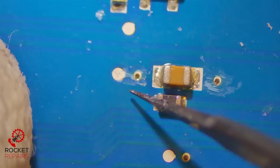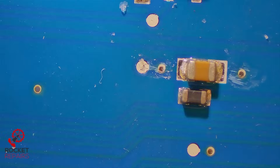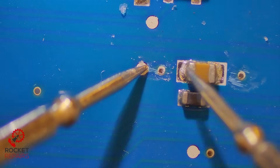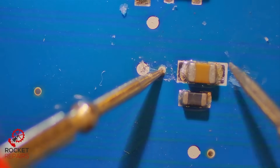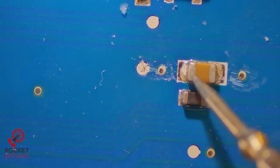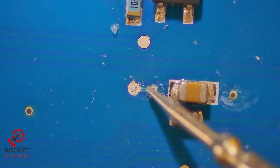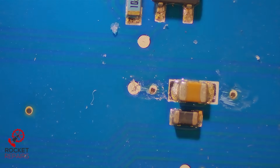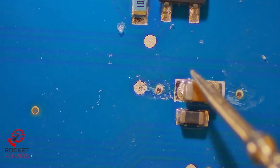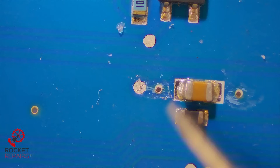We can maybe go from this pad which is a little bit bigger. Checking continuity mode — yeah, those are connected. It does run to this cap as well. So it's a continuous path to this cap, which might be the more secure place to go from. If we can just put enameled wire and route the cable all the way around the board. If I measure this in diode mode from a point of ground, we get 0.6 — so we get about a 0.7 voltage drop.